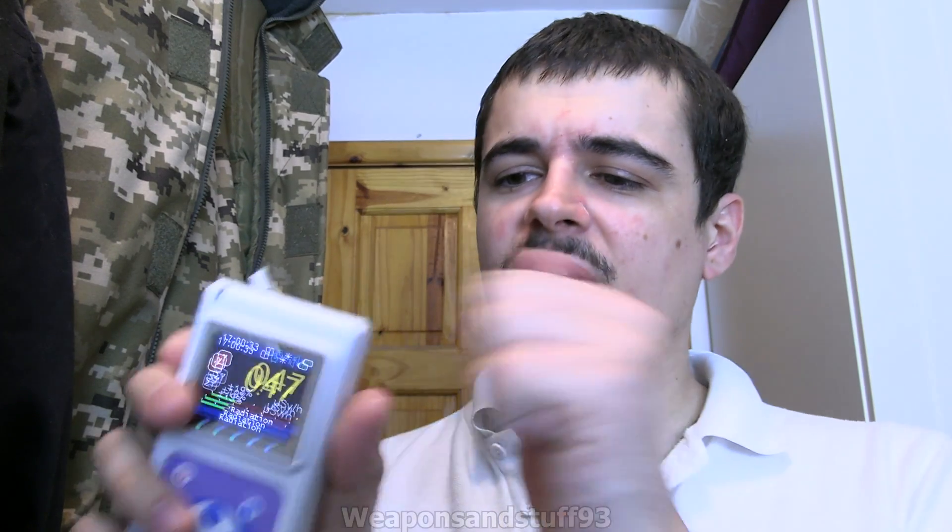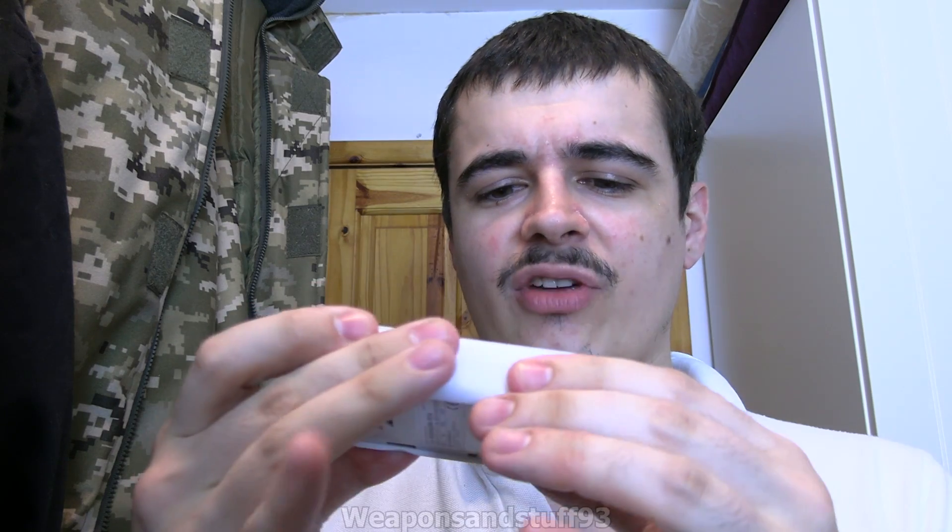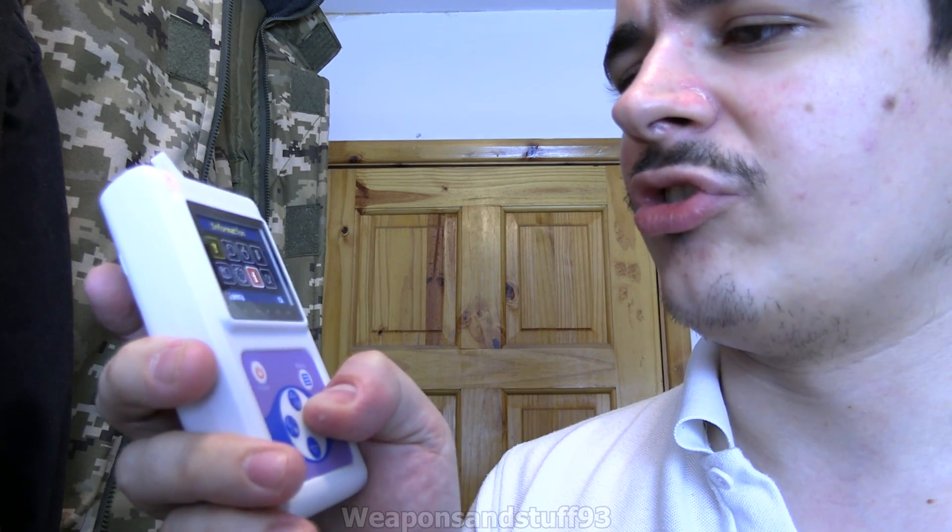If it's out of your budget range, then don't consider one like this. But for the £200-£300 price range, especially closer to £200, I'd definitely go for one. Terra-P Plus is over £200, and if I had the option of paying the same money for a Terra-P or this, I'd want this because of the much nicer display and the fact it can read alpha radiation. The case is fairly solid plastic and it's very compact — smaller than most modern mobile phones. The screen reminds me of the Soeks O1M. The menu has gamma mode, search mode, detection mode, beta flux, log, options, information, and alpha mode.